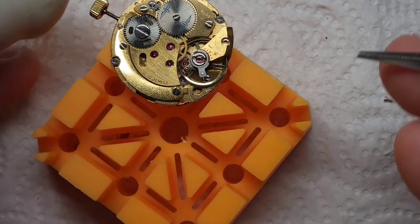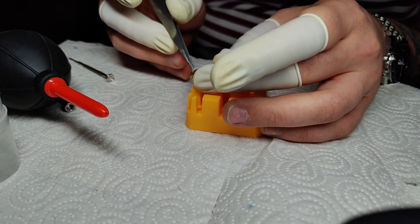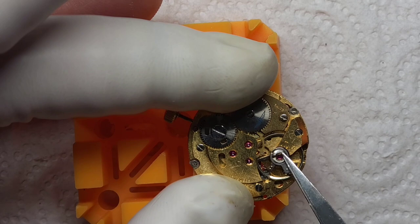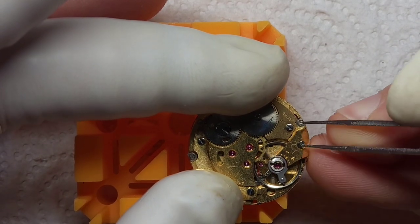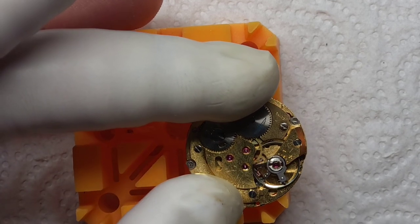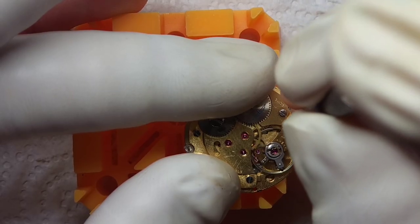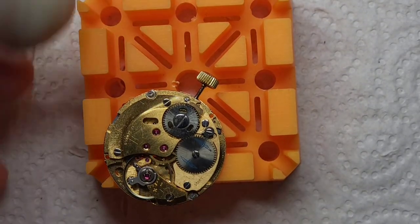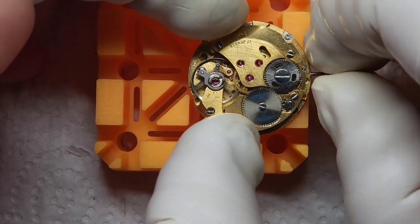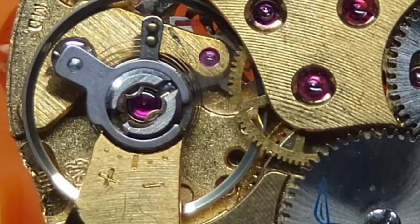It should now be ready to put the balance wheel and balance wheel bridge on, and as you see so often it should just spring into life. This is a very exciting moment — it took forever and I have cut some of it out because it took bloody ages. There it goes, absolutely brilliantly. Oh, it's stopped. What I did there is put the balance on, but the balance bridge wasn't seated properly against the chassis of the watch, which allowed the nose of it where the shock setting was to grip onto the pivot for the balance wheel and stop it from running. Luckily no damage was done. Now I can put a proper wind in the watch and she's running a bloody treat.